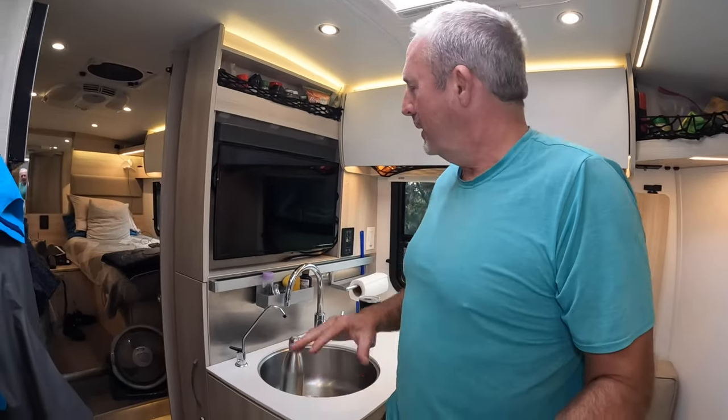Okay, so we're in the rig now and we're in the galley and we're about to use the water we have on board. I'll jump back to when I shared that we had a decision to make when we were filtering and treating non-potable water and putting it into the rig. In all cases, we're putting it through the 3-filter system, but after that, we had to make a decision between a UV light or a chemical disinfection. The UV light, if you use the water immediately, is really a great solution. It's highly effective. But when you're storing water, especially in the tropics, in a complex system, you've got clean water going in, but there's nothing to keep it clean. So if it gets slightly contaminated, bacteria and viruses can grow because there's nothing to stop it. That's why it's a great solution when you're consuming it immediately. But for us, it just didn't work.